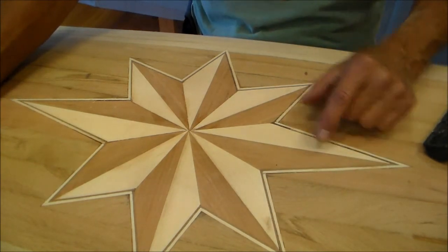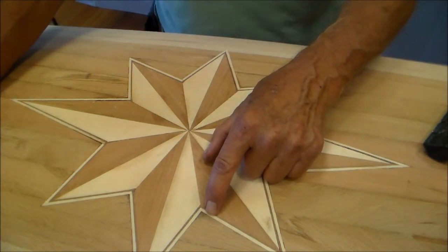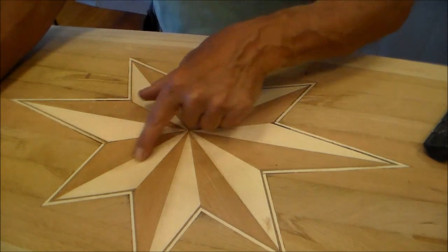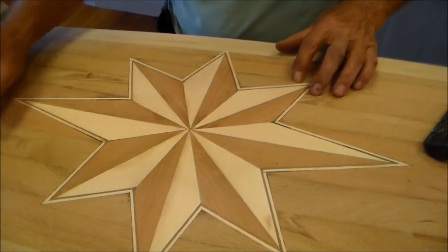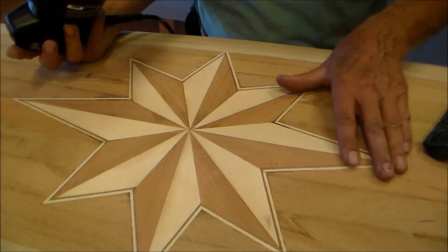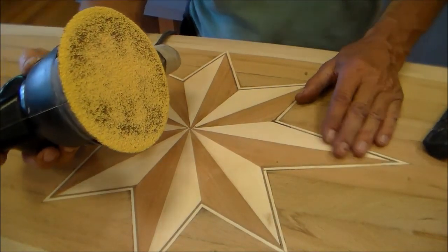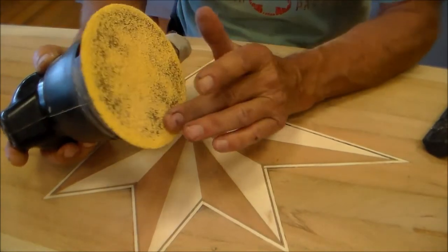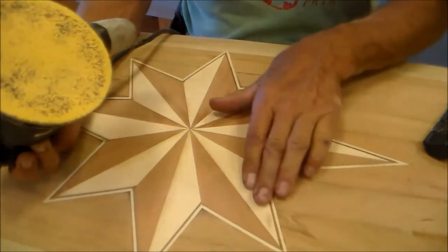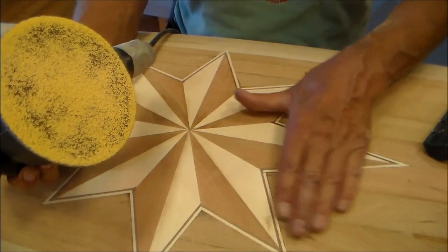If it's too deep, you'll have to fill it. Right here in the corners you can see where glue had smeared — there's one here, and I can see a bit of an image right in here where glue is smeared, so that has to come down. Right now I should be using my belt sander, but I have a repair to do on that — a belt drive broke — so I'm using a 40-grit on a random orbit sander.